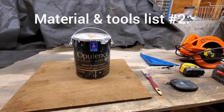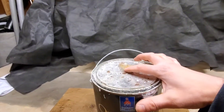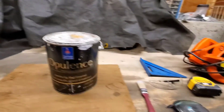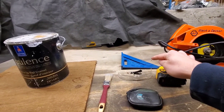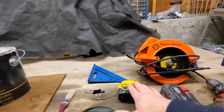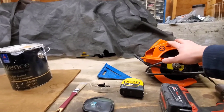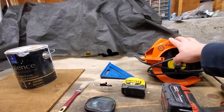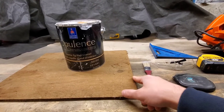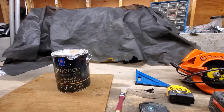This is our material and tools for the plate. We have paint, a little bit of quarter-inch plywood, a paintbrush, a speed square to use as a ruler, safety equipment — glasses and earplugs — measuring tape, a skill saw, and our drill with a 9/16 bit. Make sure in this case you use a skill saw, not a reciprocating saw, because the skill saw spins and gives you a nice clean edge, not a torn-up edge — and remember, this will be visible. Now we'll measure out for our piece of plywood.